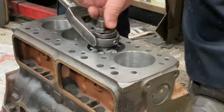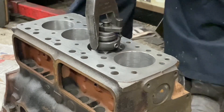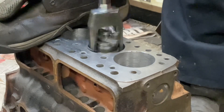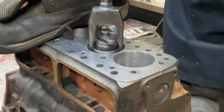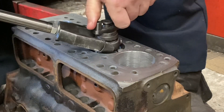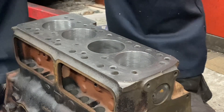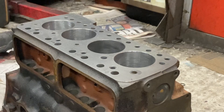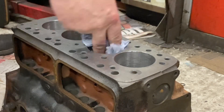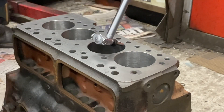So a little bit more in the middle and a little bit at the bottom. Quite a bit less energy needed for the finer stones — there's not much grip, not so much grip. That's okay, just something you need to keep an eye on when you're honing larger cylinders; you'll need a lot more power.